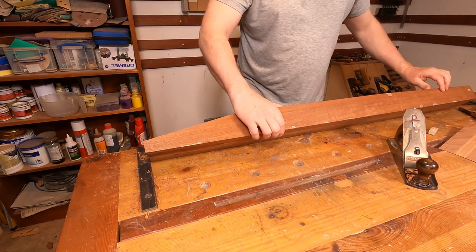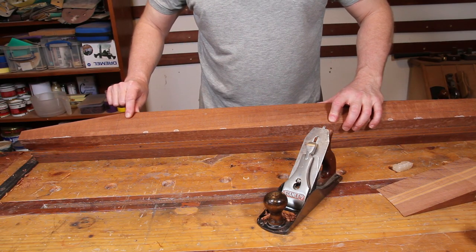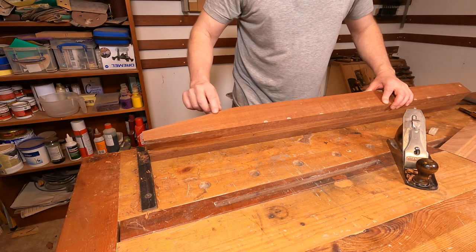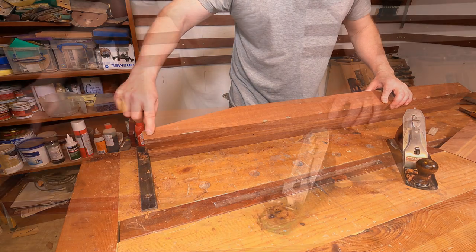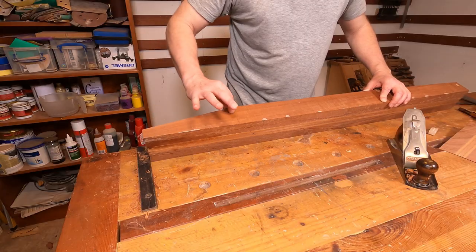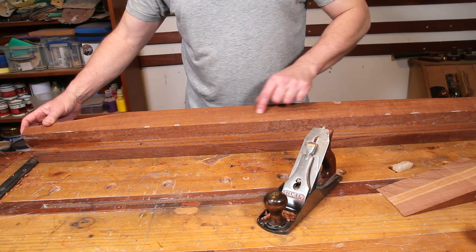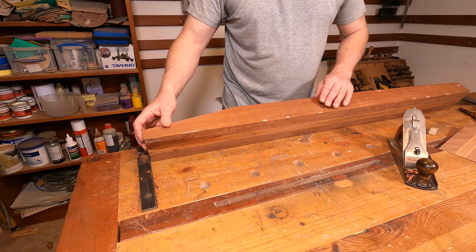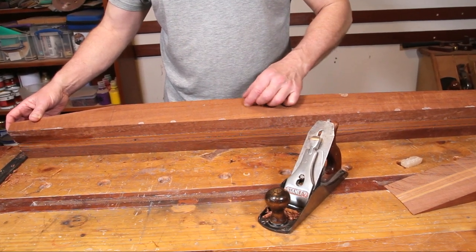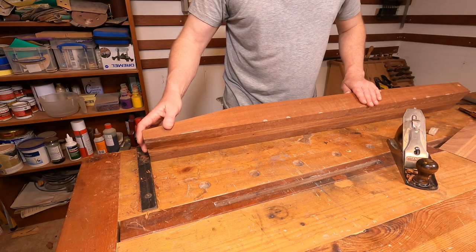With that angle established I've drawn on with the template what I need for the rest of the body and for the neck. Obviously I've changed the headstock angle so I can't use the template on that, but all I need to do is run a marking gauge down there. The headstock is marked at 15mm thick so I'll just gauge that on. I'm going to cut the body quite close to the line but leave quite a bit of material on the neck. Once this is all cut out I'll leave it a couple of days just to acclimatise - if there is some movement I've still got that little bit of material to play with. Hopefully being a multi-laminate neck it won't move at all, but you never know.